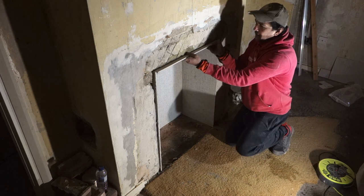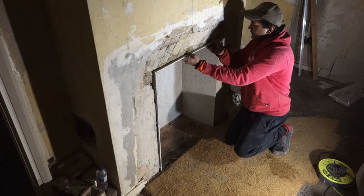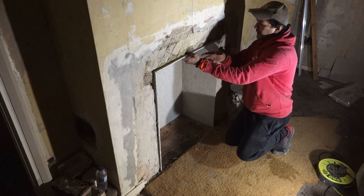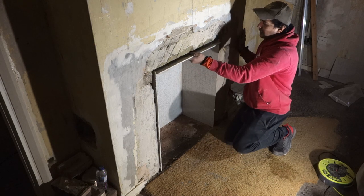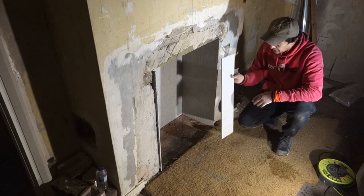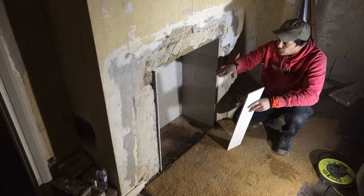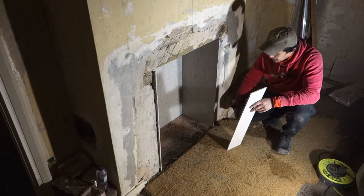It's not a perfectly tight fit. I don't know if I mentioned it before, but you don't want a tight fit on any of these, because once it starts expanding after heat, you don't want it wedging up against something. When it expands, it could bow down suddenly and ruin all your nice plaster work.